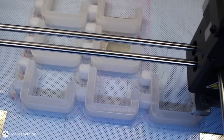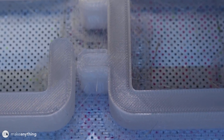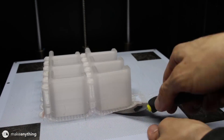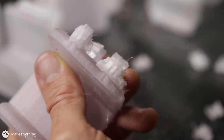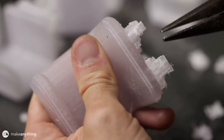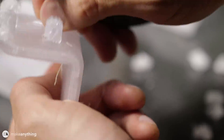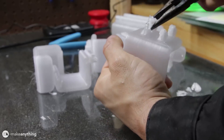We're not quite done yet, because the reason I made this whole thing flat-pack is so I can store it against my pegboard. So the next step was to print out some pegboard holders for this rig. I printed those on the Zortrax M300 using Z glass material at 100 percent infill — they came out looking super strong and sturdy with great layer quality. But when it came to removing the support material on the little pegs, I ran into a lot of trouble. Everything was gummed up and the pegs were totally filled with support material, even using the light fill option in the slicer. I just wasn't able to remove it and unfortunately had to trash these parts.